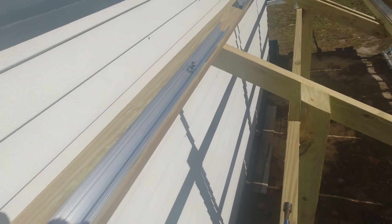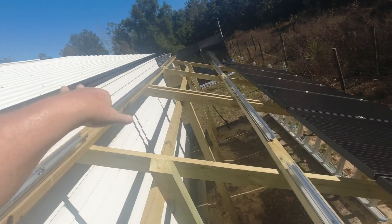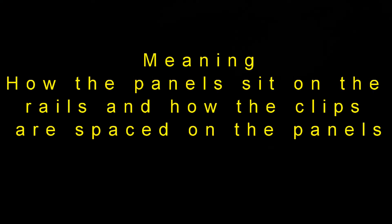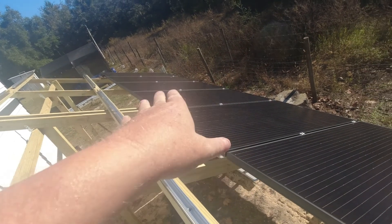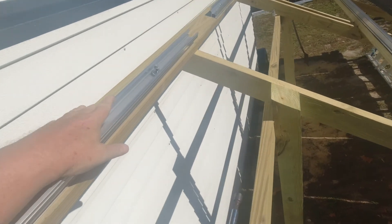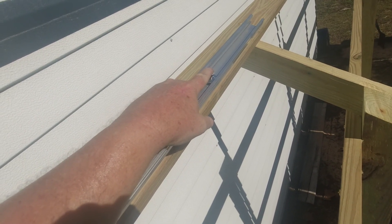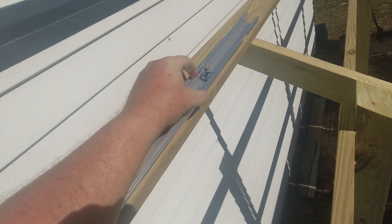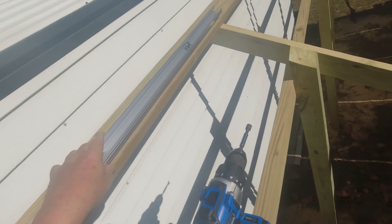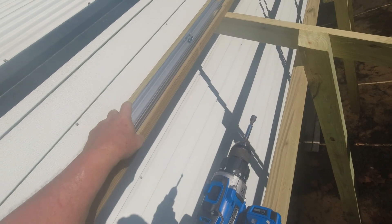Down at the last row, these are fairly even and evenly spaced. The tops have less support than the bottoms because when I measured those down there, it was for the bigger panels. To hold everything in place, I'm using a 12 by 2-inch self-tapping screw with a quarter-inch by one-inch washer. I'd rather have two-and-a-half-inch screws since the tip takes up about a quarter inch. There are four screws per track, so I really don't think they're going anywhere — this thing is built like a moose.